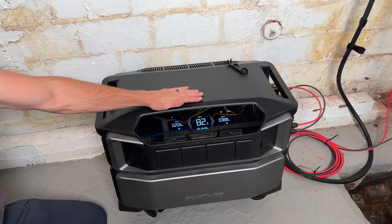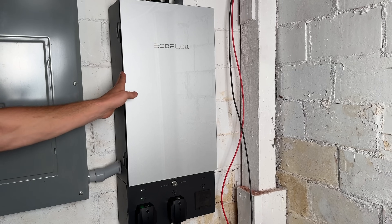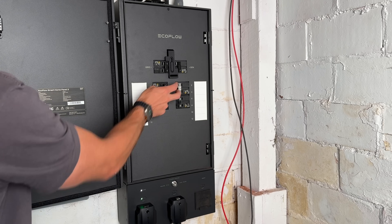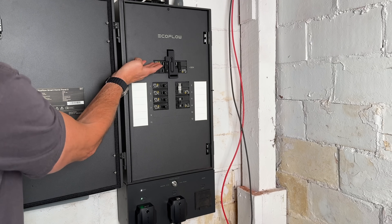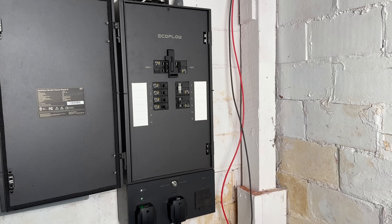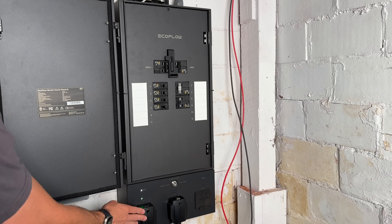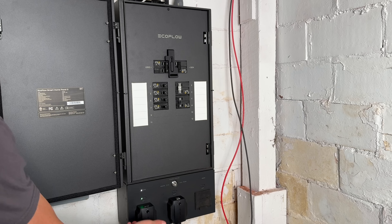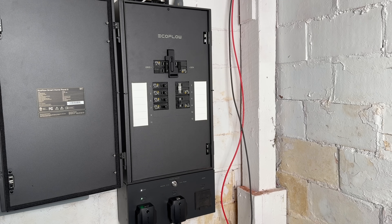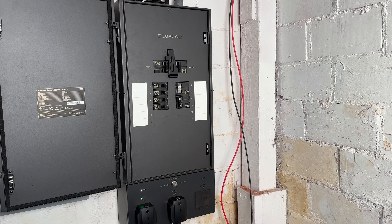From solar input capabilities, you have 5,400 watts of overall solar input, which is an extremely capable unit. Then we have the Smart Home Panel 2. This has 12 different 120-volt circuits — you take up two slots for all your 240s. You can bring grid tie-in with a 100-amp breaker and also pull in a generator with a built-in interlock, which is a super handy feature. The bottom box is detachable so you can mount the panel elsewhere. It should be noted there are integrated relays, but the breakers are common brands you can find at your home improvement store.